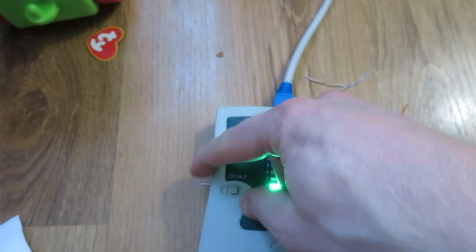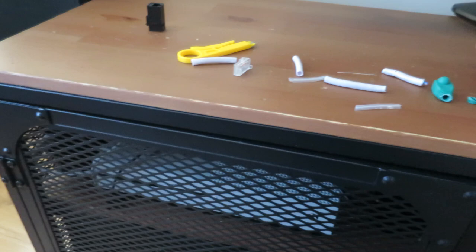So I'm thinking, did I follow, because on the back of the faceplate, they've got the other configuration. I always have this bit of paper handy because I don't have the kind of brain that retains this information. This is the B standard. I always have this bit of paper handy in my little network toolkit here. So everything I do here at work, wherever, is always this standard, unless I know for a fact that it is something different on the other side.